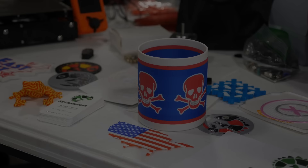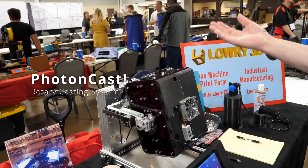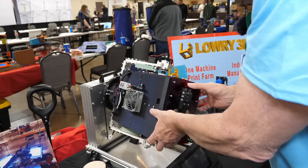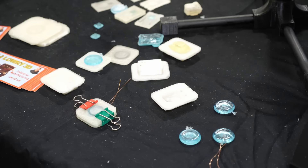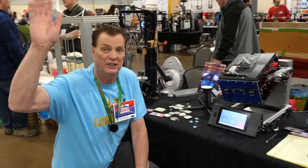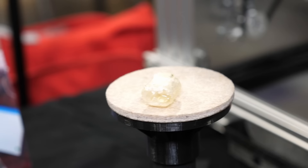All of the projects we've looked at so far were extrusion-based, so the last one I really wanted to show you is the Photon Cast by LORI3D — a rotary casting system for UV resins. The idea is simple yet clever: you print a mold using translucent filament, add some mold release, pour in resin, and install the mold in the fixture. As it rotates, it covers all surfaces with resin and then blasts it with UV light — after just a minute, you've got a finished part. You can even change wall thickness in different locations or embed electronics in the parts. Charles told me his idea is for the Photon Cast to be an affordable machine for mass production, with flexibility due to easy mold manufacturing and quick cycle times — he plans to launch on Kickstarter this year.